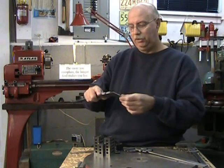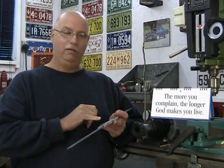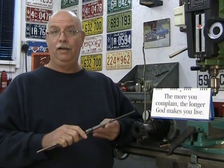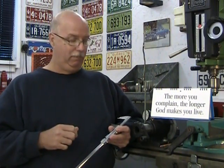In a few minutes we're going to look at how to read this vernier caliper — this one, because it has a large and easily read scale with quite distinct lines, making it easy to show on camera. It also has metric and imperial on the same side. You may have noticed that vernier scales vary quite a bit in length, number of divisions, and so on — and that means each one has to be read differently. Not true! They all work the same way. And a good way of learning to read any vernier scale is to learn how to make your own. Let's head over to the whiteboard.